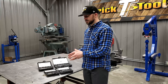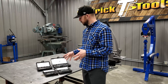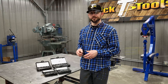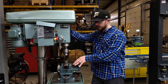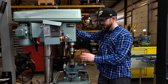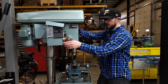If you have any more questions, you can give us a call and get those answered. What we're going to do now is put one of these bigger ones in the drill press and show you a cut so you can see how nice, precise, and clean the hole is. We've got the Roto Cut set up — this is an inch-and-a-half size — and we're drilling through some two-inch square tubing, not super thick, but just to give you a demo of how nice and clean and straight this cutter goes through the material. We've got the center punch marked and lined up with the arbor.